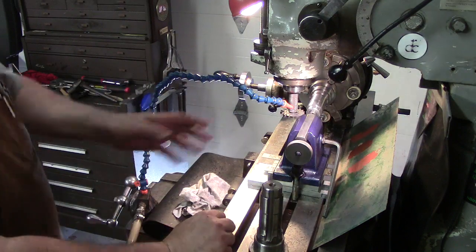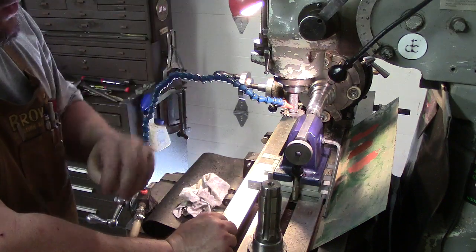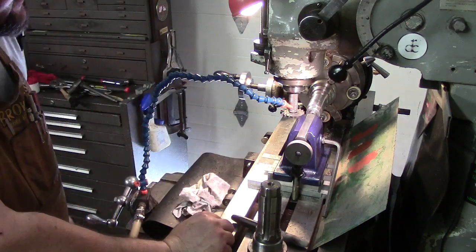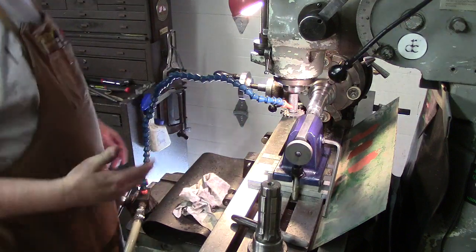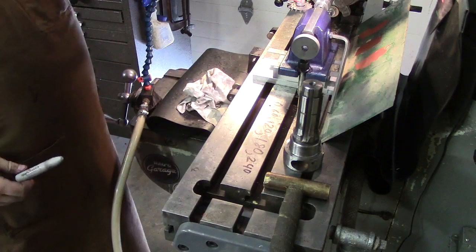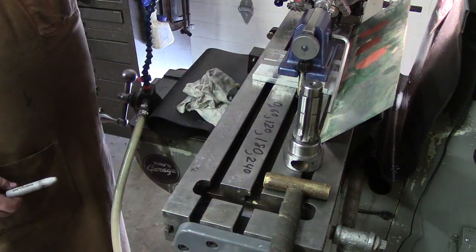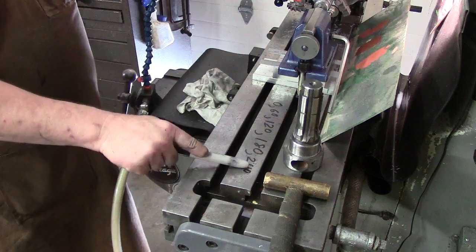Cut this, and then we come back and form our little angles and use this to create our form and our bevel. Ideally if you did this all the time you'd have carbide tooling that cuts this, and in a perfect world it would be great. But I'm doing this manually. We've got the first one cut. We're doing divisions of 60. We cut to zero. I always like to write things down just in case you get distracted. You can see where I've written it right here, so I know where I am if I have to stop.